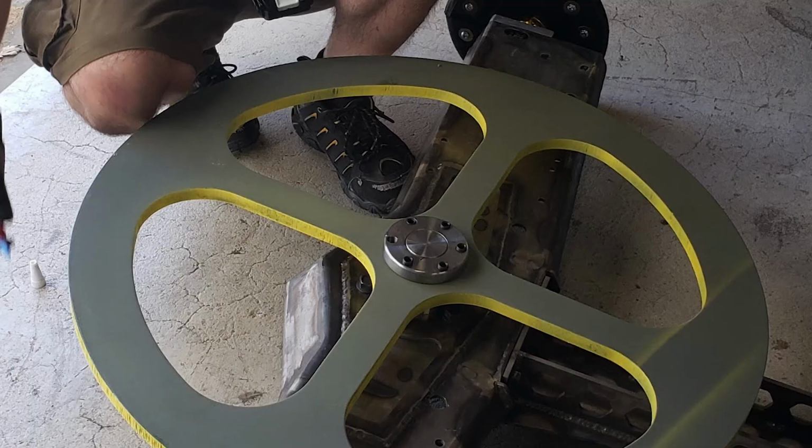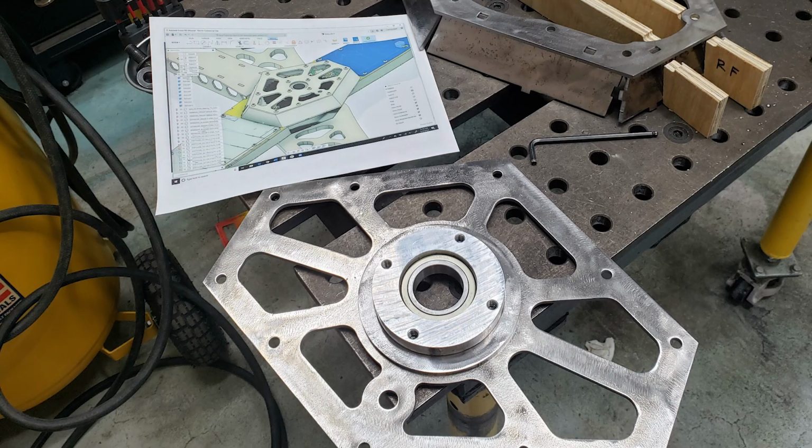Because the loads all the way around the weapon shaft during a hit are just massive, up to 44 kilojoules of force, and we have to absorb that energy or rip ourselves apart. In 2019, the bushings inside were made by HiJinx, and on the bottom we had our classic weapon capture, the Giganut. And in the topmost armor panel, we had a bearing to constrain the side loads and help the shaft spin true. The 2019 HiJinx had a flat top panel on the head that bolted on the same way as our flat wing panels do.